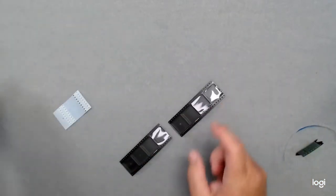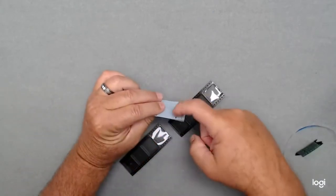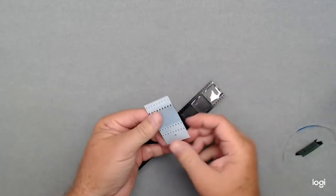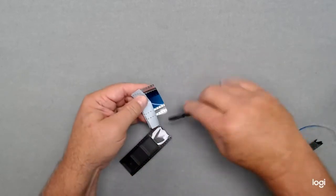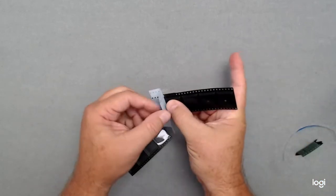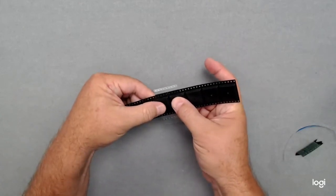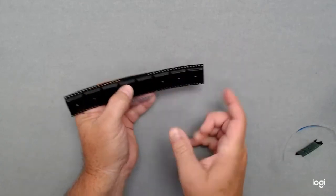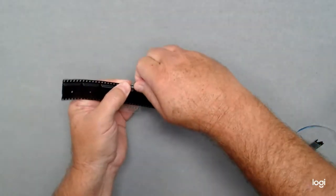Tape is cut. Again, we go to our self-aligning splice with the pin jigs on it. All you need to do is start to fold the protective cover back, put the tape on, align the pin pads on that, do the second side. Again, you'll see the alignment with the perforated tape.